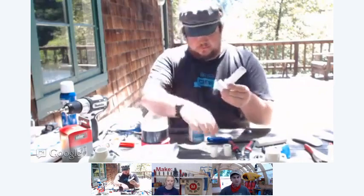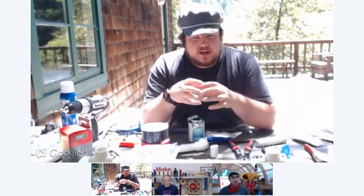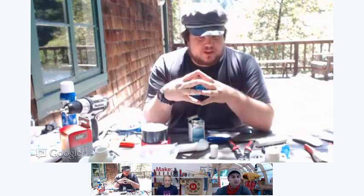Hey, Dan, I have a question from one of the campers. They're asking, would using brass fittings together with PVC pipe compromise the seals? And is it fairly easy to incorporate both metal and plastics into this sort of project? You have to be a little bit careful when you're threading brass parts through the coupling, because sometimes it can push the pipe away from the coupling and cause a leak. So you just have to take your time. Maybe with the larger fittings, you want to use an actual pipe tap to pre-thread it. But otherwise, using metal fittings on PVC parts is no problem at all.